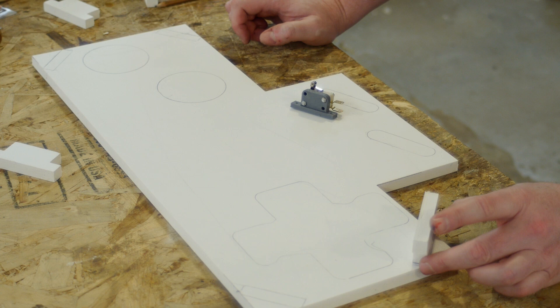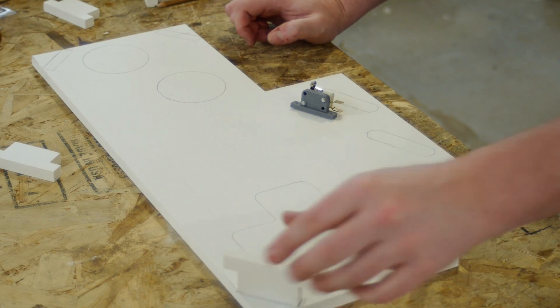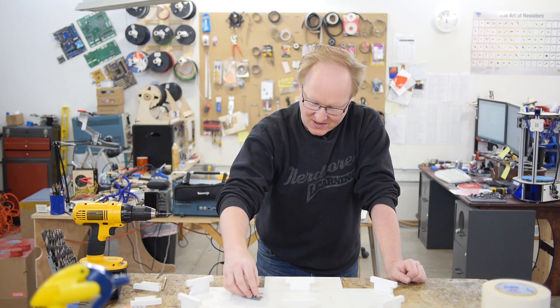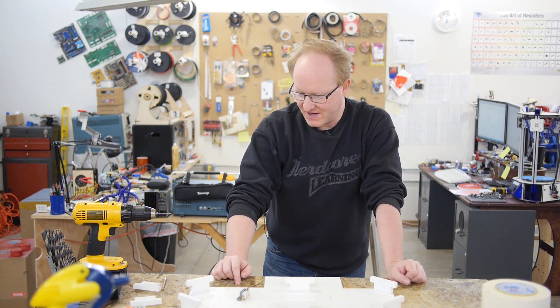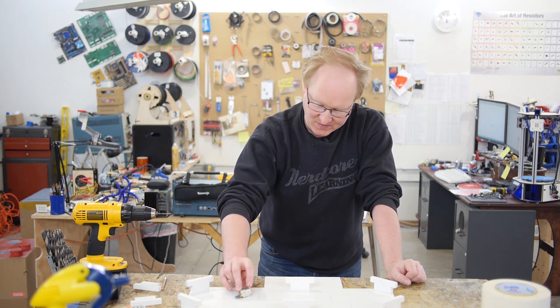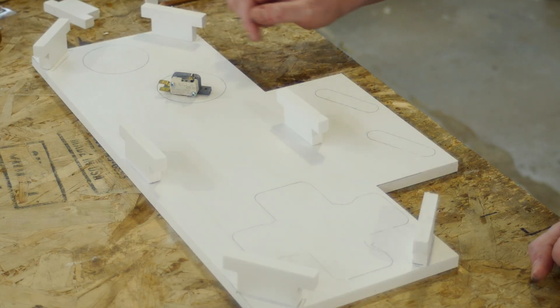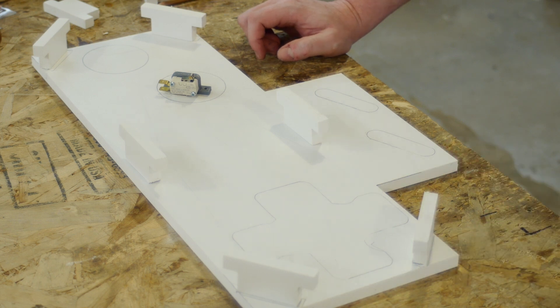This is my control panel board — I'm just hooking it up manually. I'm going to have support feet here, then use these 3D printed snap-action switch holders to sit under the buttons. There'll be a piece of foam the same height so the buttons won't press the switches under their own weight — you'll actually have to push them to compress the foam and trigger the switch. I'll manually position these and attach the feet to make sure everything fits inside the case before we paint.